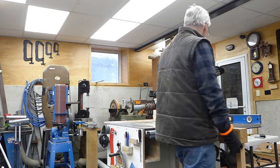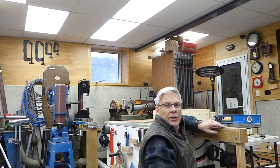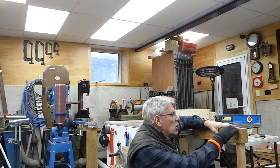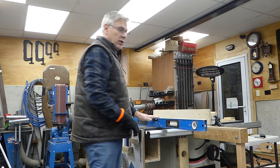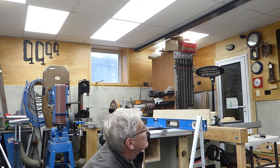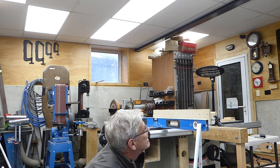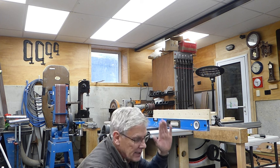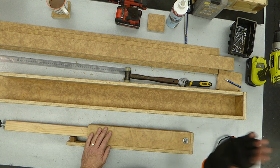I'll cut the leg for the new one. This one has an adjustable foot on it. I'm not going to put that on the new one — I'm just going to cut it directly to the level of the floor. So I need to check the height between the top of my saw and the floor, and I'm just going to use my level for that — not actually looking at the level, just using it as a straight edge. So I'm going to cut it at 892mm. I'd rather this was slightly lower so it doesn't lift. I'll give you a little idea of the difference between the two legs I'm going to make for these.